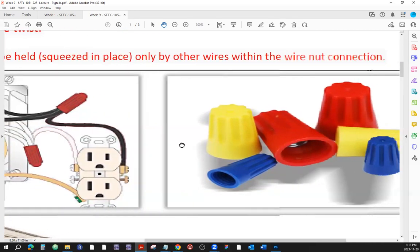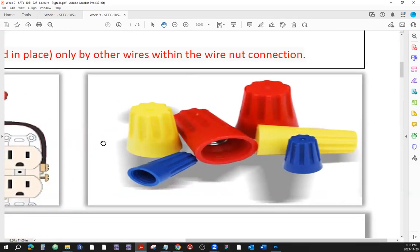Now, for the pigtails, there's that new WAGO type of connectors. Some people like them, some people don't, and that's all I'm going to say about that. One of the most popular ways of connecting the pigtails is using those twist-on wire nut connectors. They used to be called Marettes, and sometimes they still are. It's just a residue terminology from when Marette was the only company producing those, same as Xerox for photocopy.